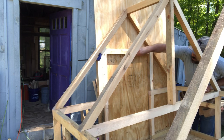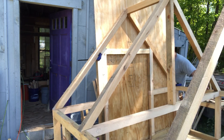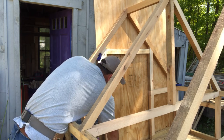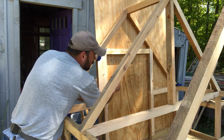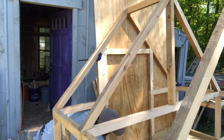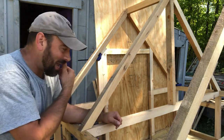Now the inside of the door — right to the corners, all the way to the bottom. This is going to have my hinge side on it, so I'm going to put an H. And then on the other side of the door, I put an arrow as to which side is up and which is down when I cut this door out. That's where the hinges are going. And there is one little lip down here — that's going to overlap that little bit of plywood. There is a half-inch gap there, and I'm going to mark that to remind me.